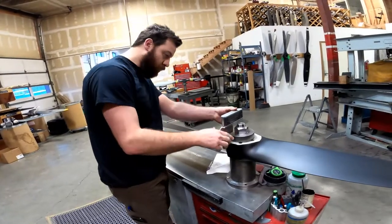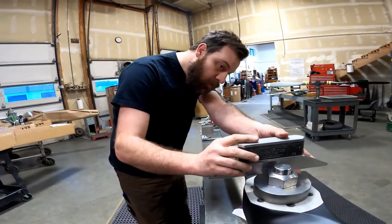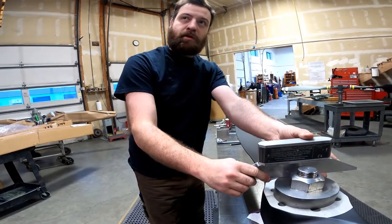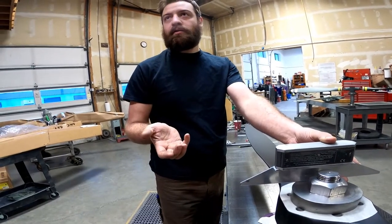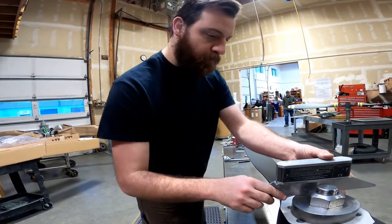Electronic blade station protractors that get calibrated again once a month to make sure they're accurate. I'll zero it to this bench. Each bench, just depending where it is in the shop, is a little different. So before we measure, we always zero the protractor to the particular bench we're working on.